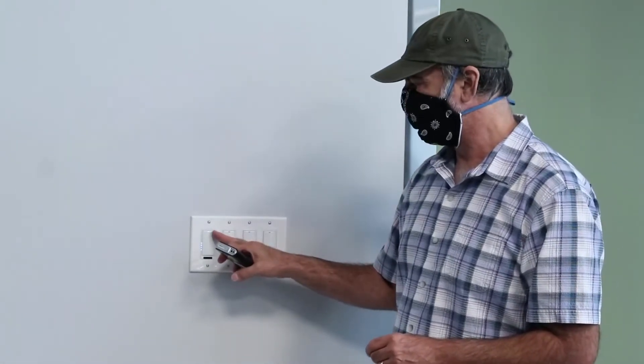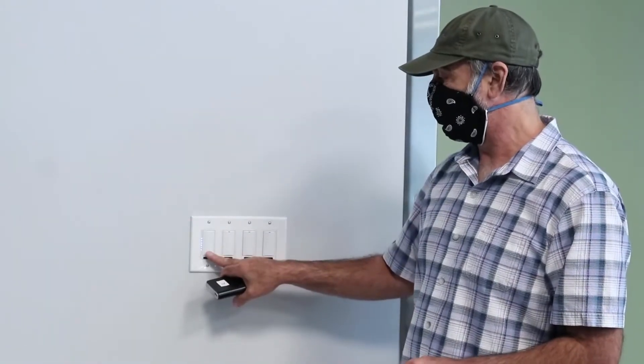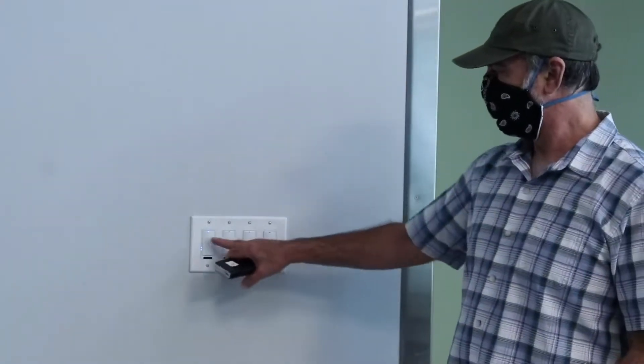The dimmer here allows you to override the daylight sensor. If you see certain lights near windows that appear dimmer than others — that's the daylight sensor at work. The bright lights are likely emergency lights, which by code must be at full brightness and can't have a dimmer. The dimmer or more yellow-looking lights are being directed by sunlight through the daylight sensor. During after-hours mode the override is active; during the day the switches are locked out, so the daylight sensor does all the work automatically.